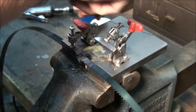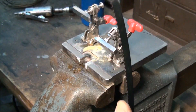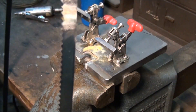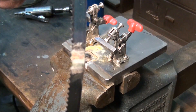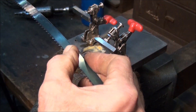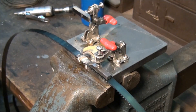And that should be it — we've got a joined blade. Now we have to go back and clean up any extra solder on it. It's pretty even, but it has to be able to go through the guides in the saw, so we have to dress down any extra silver solder so it doesn't grab on the guides as it goes by.